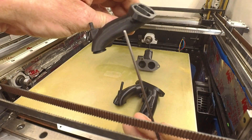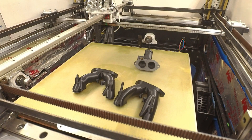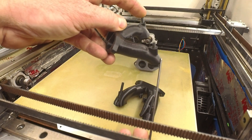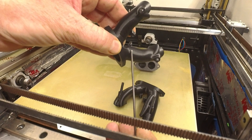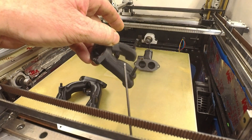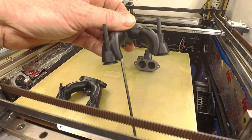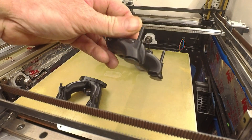On my original duct I've got a loft that runs here all the way to about this point, and another loft that hits in here — you can kind of see this line. When you make multiple lofts you'll get lines like that. Whereas this particular duct is one loft from here all the way back. This change right here seems to have helped quite a bit.